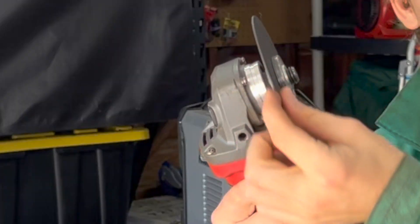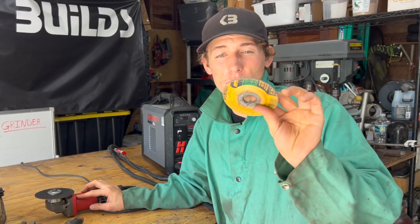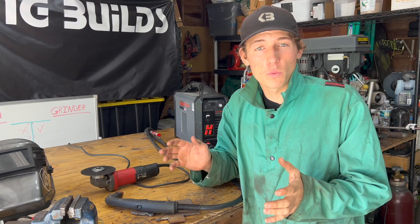So if you want to make a complicated design with a grinder, you might have to cut a square and then use a grinding blade. This is a cutting blade — it's nice and thin. The grinder blade is thicker and more worn. With the grinder you keep filing away at it to get the shape, but with the plasma cutter you can just cut any shape you want.